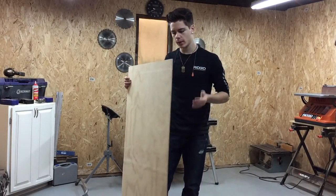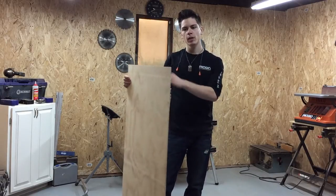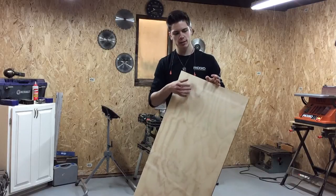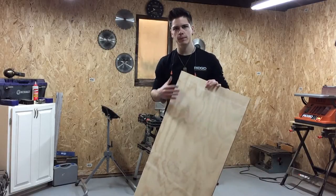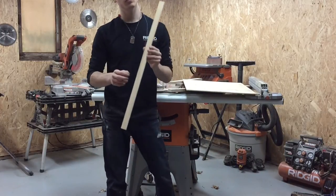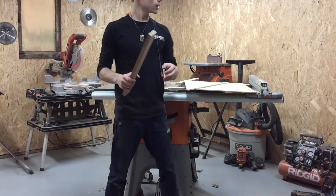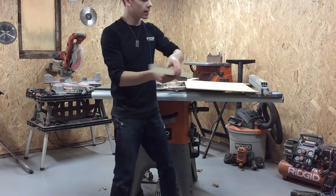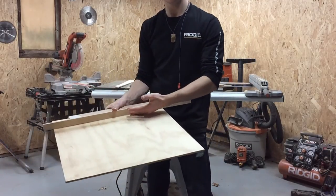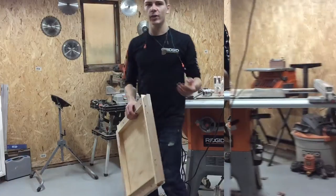Back in the shop — we're going to get started. This quarter-inch board I'll rip into a 20 by 20 inch square so we have room to work around the 16 by 16 inch concrete base. We'll also rip some one-inch cleats to make the form for the concrete. Now we should have one board about 20 by 20 inches and four one-inch rips for the thickness of the concrete. I also ripped some two-inch pieces as backers. We'll nail this down — this is the inside of the form.